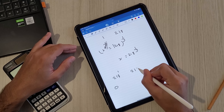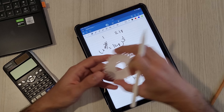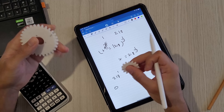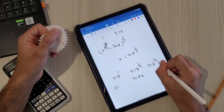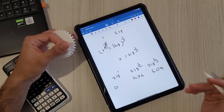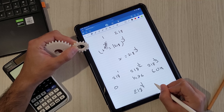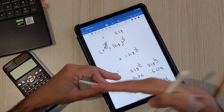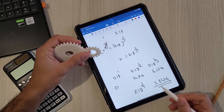We don't need to go further than 4 sets, since each set of gears we add means more friction. So finally we will have 4 sets of gears with a ratio of about 3.84 between them. We know the ratio between a pair is about 4, but there are infinite ways to get 4 — for example, 10 teeth on one gear and 40 on the other, or 60 and 15. We need to consider whether the tooth numbers share common factors to avoid accelerated wear.